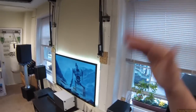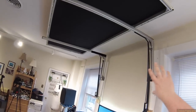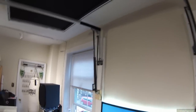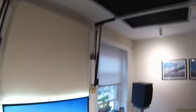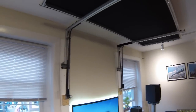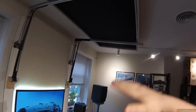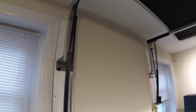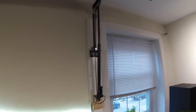There were many revisions of the lift system. I tried pneumatic lift supports — the ones from Amazon were only about 60 pounds lift each, not enough to get it up. Then I got 180s from a lift support depot and they got it up to the ceiling, but bringing it down tried to break things — way too strong. 120s did a better job, but the effort to move it up and down was too crazy, so I invested in linear actuators.